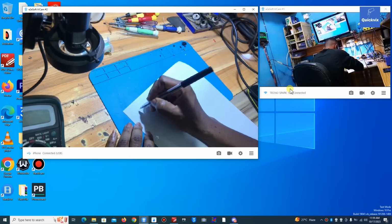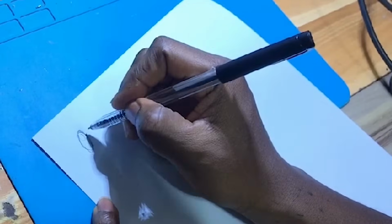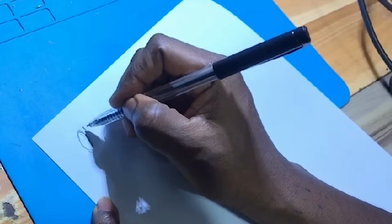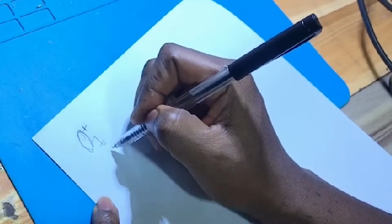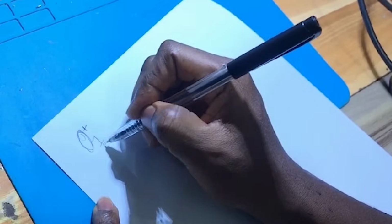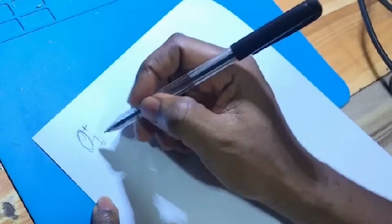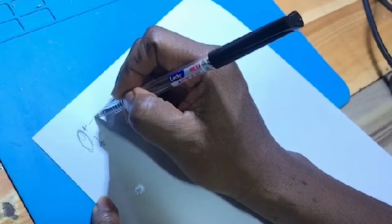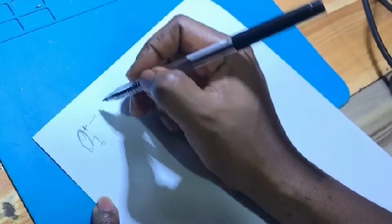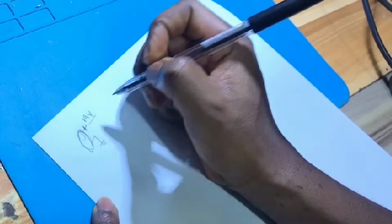let me assume this is the charging port. We have our positive here, and this is our negative, which is connected to ground. So we will not focus on this, because of course it's connected to ground, every other negative side will also be connected to ground, so we just focus here. So this is 19 volts, or any voltage.